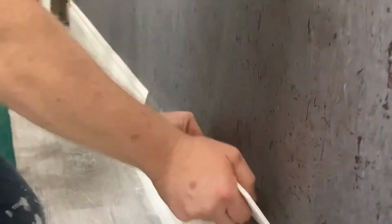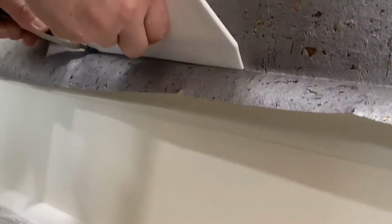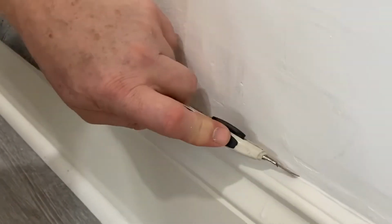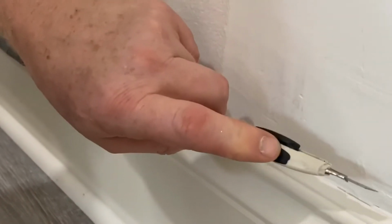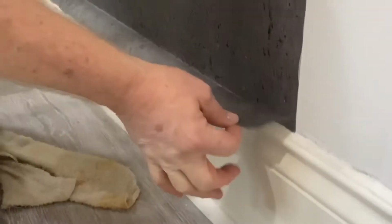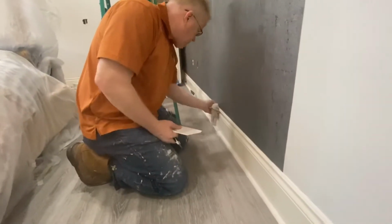The same angle you use with the smoother, I want you to use with your blade. With the hand you're cutting with, push that blade as close to the wall as you can. Remember I said earlier in the video, not like this, but like this. Big difference. When you do it like this, you're using more of the blade, the shaft, beyond the tip, in order to help your cut. And then you get a clean cut like this. Clean off our trim, barely touching the wall covering.